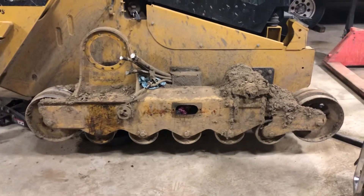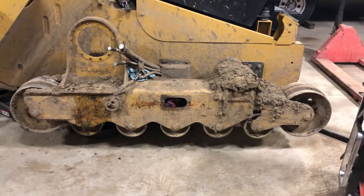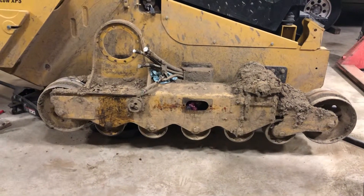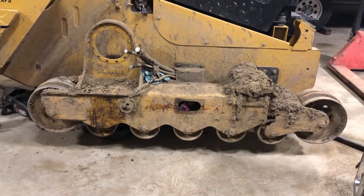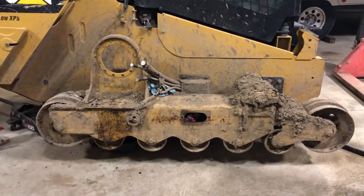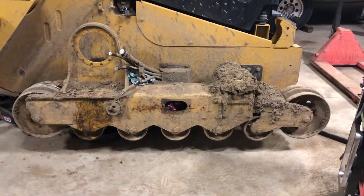What's up guys and dolls, Junkyard here working on a Cat 299 — kind of a dreary cold day. I thought I had a brake problem with this because you'd go to move and the right side would hang up and kind of pop. I pulled the cover off, checked the planetary, everything in there looked good. So I checked pilot pressure — pilot pressure was good — felt their odds and ends, so I determined the motor needed to come off and pulled it apart.